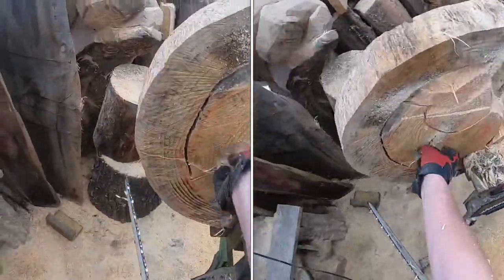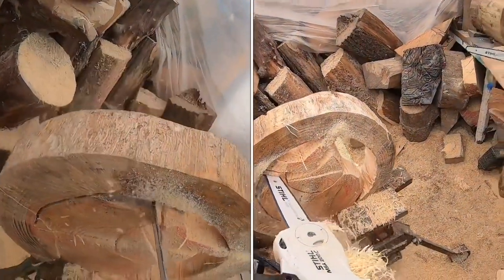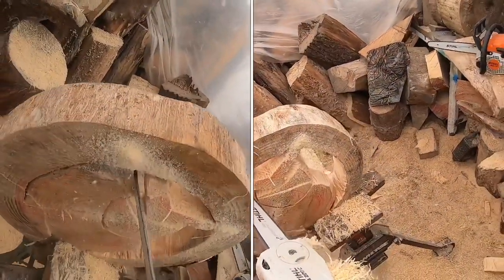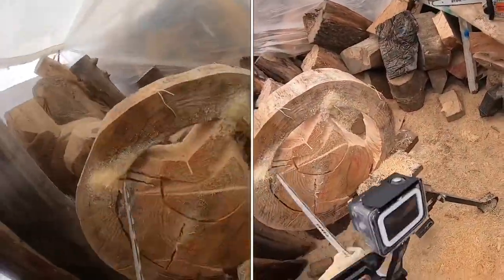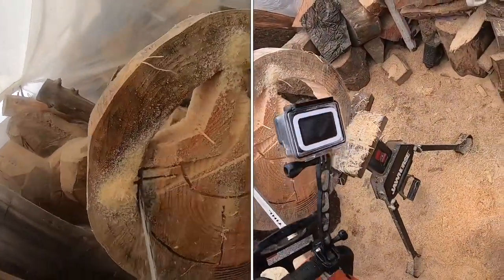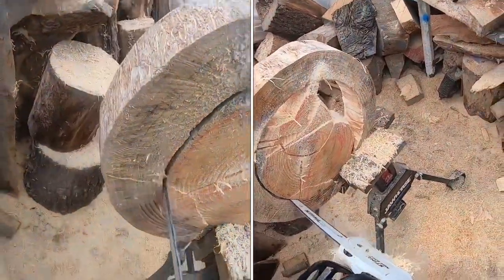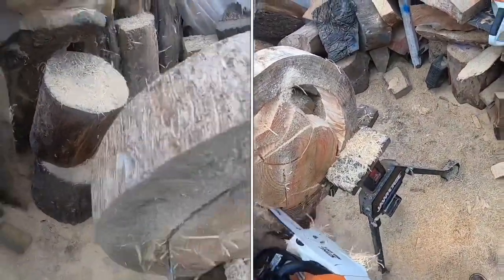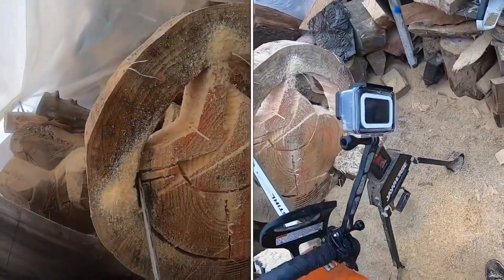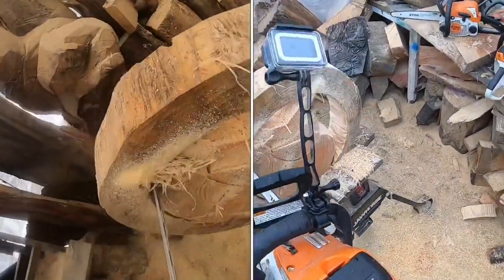We're making plunge cuts — remember, use the bottom of the nose, not the very tip. These cuts can involve quite a bit of kickback, which is why it's important to wear your safety gear. Grip that saw like you stole it. Be safe — think about your cuts, your space, what you're cutting through, what's around you, your footing. Be safe, have fun, and pay attention.